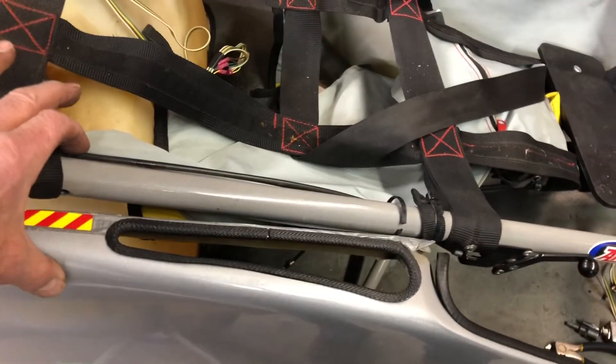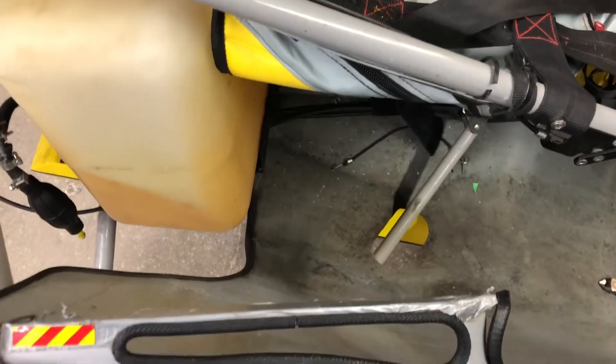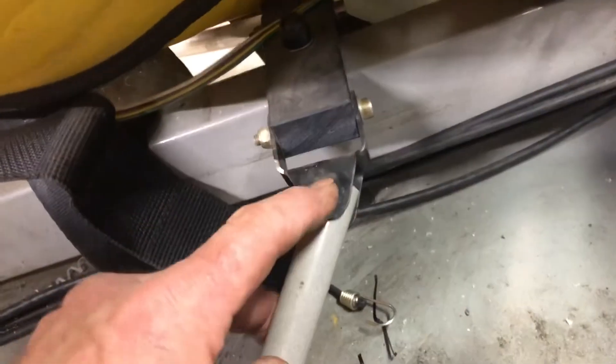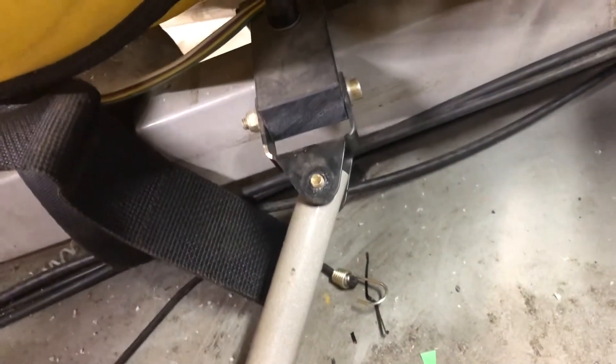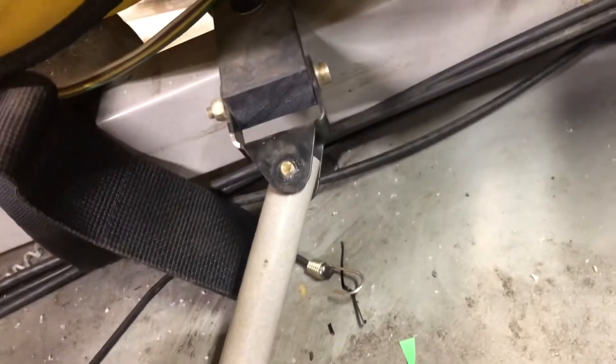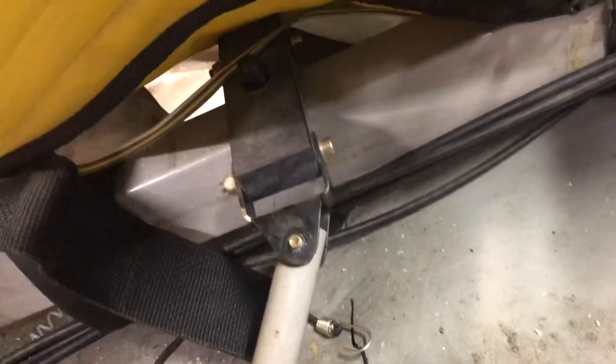Next up is to take the tank out. We've undone the bolt from here — it's very light and very thin, and it's warm in here so I'm not afraid of flexing the fiberglass. However, I'm getting stopped by the suspension strut, so I'm going to take this bolt out so it won't be in the way. Typically on an airplane, bolts face down and the nut goes on the bottom. If the nut ever fell off this one, gravity would make it fall right in — so I'm going to put it back the other way afterward.